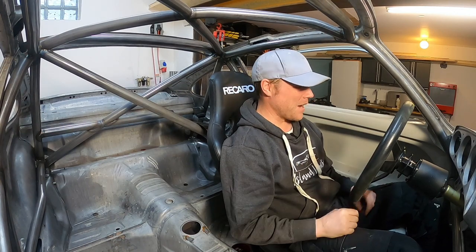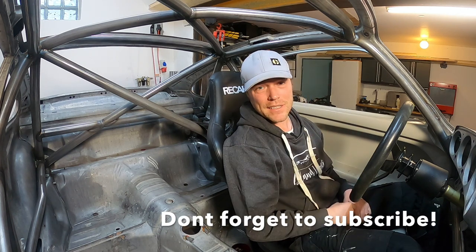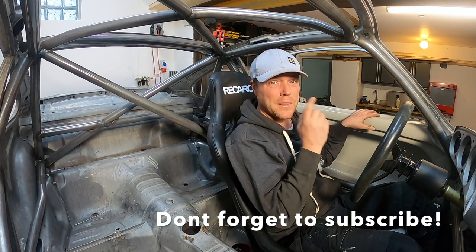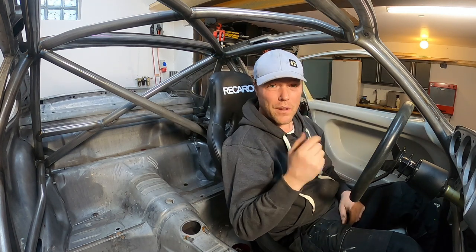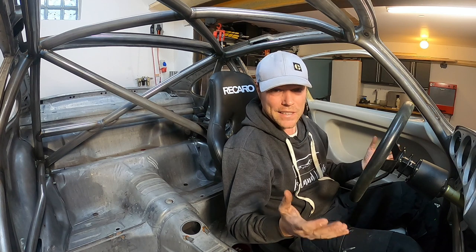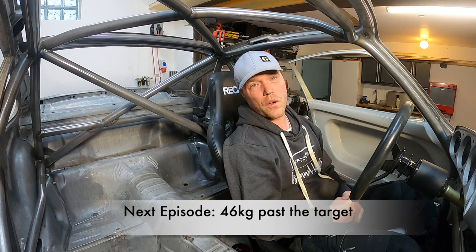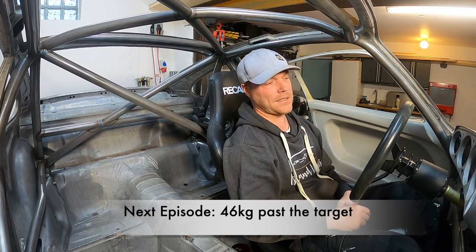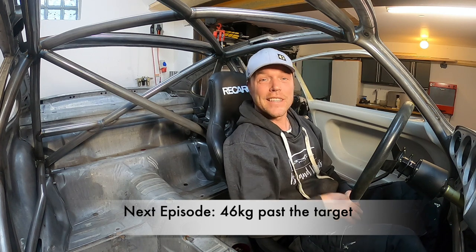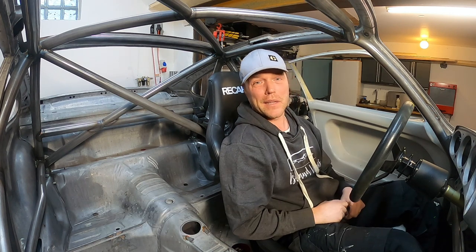We did some cool stuff today and I'm psyched to be sitting back in the car after such a long time. We looked at the steel doors, weighed them, and took out the necessary parts to transplant into the plastic doors. We looked at the roll cage — thanks Robin for the help, the result is fantastic. In total we found 25 kilos of weight saving when accounting for the cage weight. Started the episode at 221 kilos identified, now we're up to 246. Subscribe to the channel — next episode we're doing some funky carbon fiber stuff!